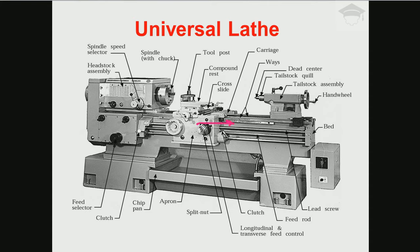This whole carriage can be moved in the forward or backward direction to accommodate the length of the workpiece. We have a wheel — turning it clockwise moves the whole carriage in the forward direction, bringing the tool closer to the workpiece. Turning it anti-clockwise moves the assembly in the opposite direction. We adjust according to the length or dimension of the workpiece.